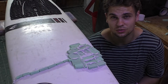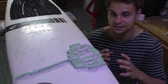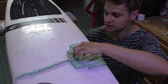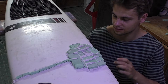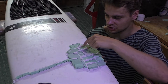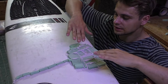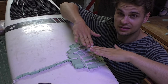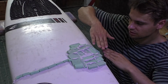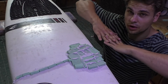What I used here is resin with micro balloons. The micro balloons expand the volume of the resin while the weight stays about the same. Into the resin I push little Airex pieces to save some weight, plus I get a cross structure between the little pieces. I could have pressed a whole plate of Airex into the dent, but if I did that I would have to use a vacuum to push the plate in, and I'm afraid that process would have destroyed the rocker curve.